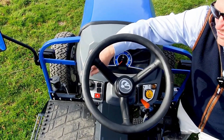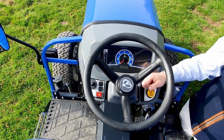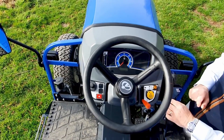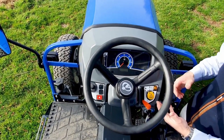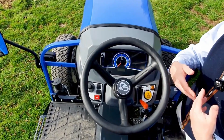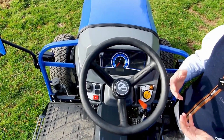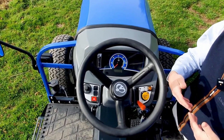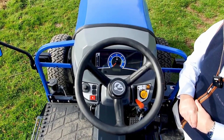There are two controls I'll talk about more shortly. Moving to this side, we've got the hand throttle - easy to operate - and the PTO. The PTO engagement has a nice feature called soft start, so instead of the PTO engaging suddenly, I can press that button in and you'll get a slow engagement. As I turn and pull it up, that's the PTO engaged. The soft start means the implement on the back starts nice and slowly, without putting a lot of stress on the implement or the tractor.